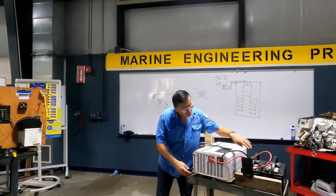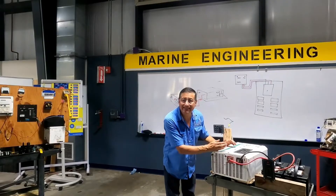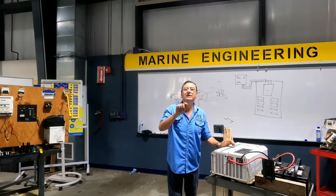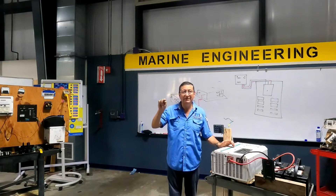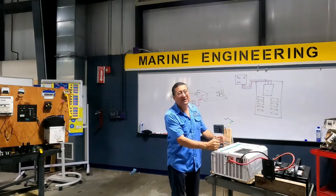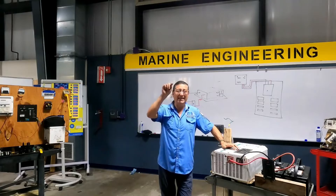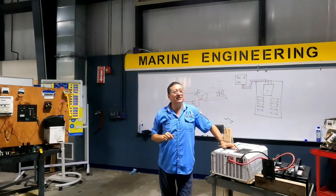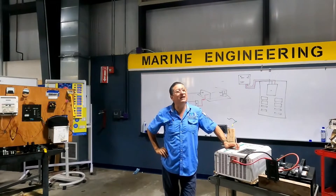I need a battery bank to supply DC power and this equipment converts the DC power into AC. Is the signal perfect, a sinus signal? No, it's a little square. In some cases if the inverter is not a professional inverter, it's like a triangle.